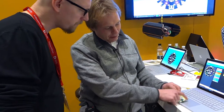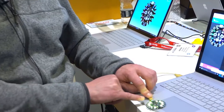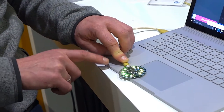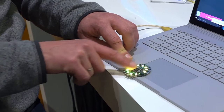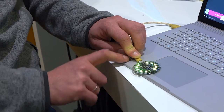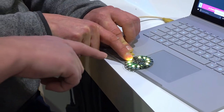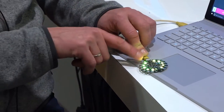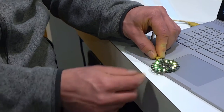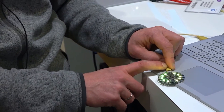We have capacitive pins all around for wearable stuff — you can sew through them. We have SPI and I2C. On board in the center we have a motion sensor, two buttons, a slide switch for on/off operation, a microphone, a speaker, a temperature sensor — there's a little printout you can actually read on the board — and a light sensor. You can power it via the JST connector. It's a very cool educational board that lets you do a lot of activities without breadboarding.